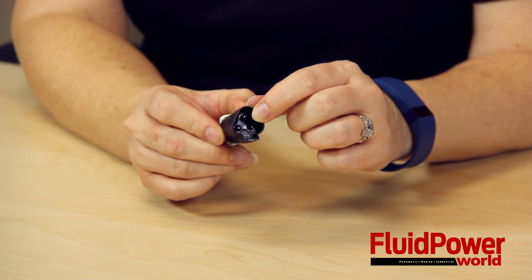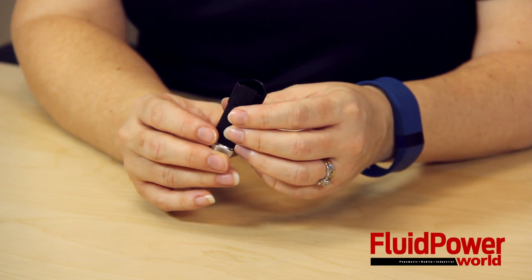The MH3's case is made of fiberglass reinforced thermoplastic and features a metallic shield inside for EMC resistance. It also offers a hermetically welded thin film measuring cell for long-term leak tightness without the need for additional sealing materials, and it also offers an IP69 rating. WIKA says that all of these features make the MH3 extremely resistant to temperatures, shock, vibration, and pressure spikes.